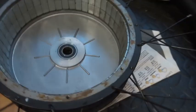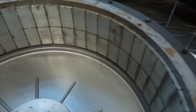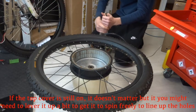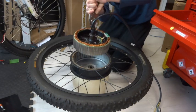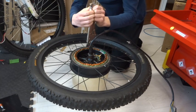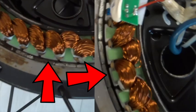Once it's through, you can just remove the arms and pull the puller out, which gives you access to the inside of the hub. These are all the magnets that run around, and then you have the stator itself with all the copper windings. When putting the stator back in, rest the housing on something hollow but sturdy like a bin, lower it gently over the top, make sure the shaft goes through the bottom bearing lined up square — and then suddenly it will pull in as the magnets pull the iron stator down.